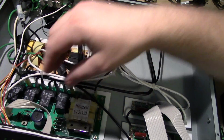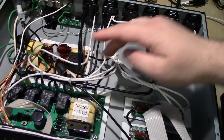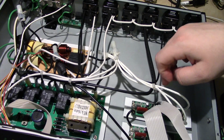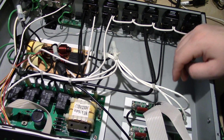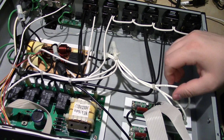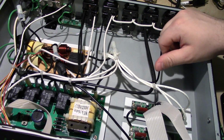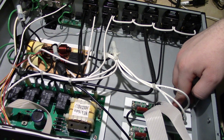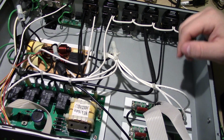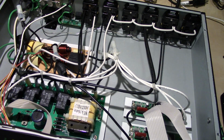And not much else. Looks like there's a microcontroller attached to the end of this board. And up here, these are just the voltage and the current sense boards. They look like they use like a little capacitive dropper or something to power them. The chips are made by Sonix. Not sure, a little odd, I've never seen them. They've got like a big current shunt on them. No, it seems decently made.